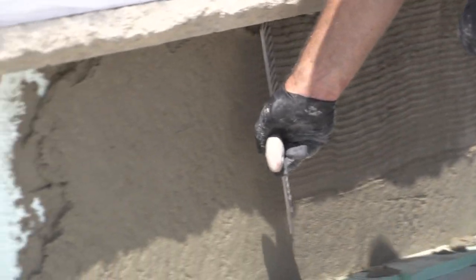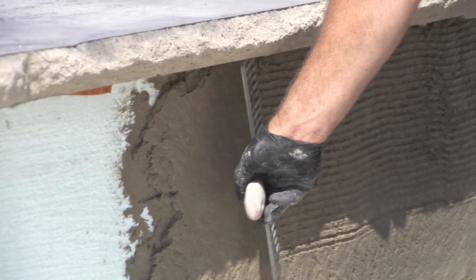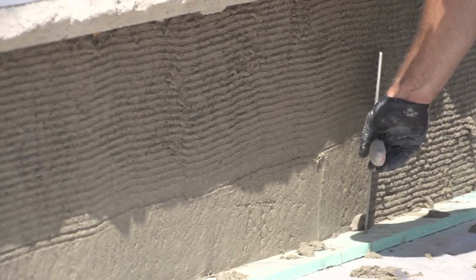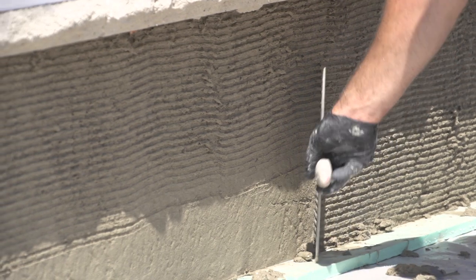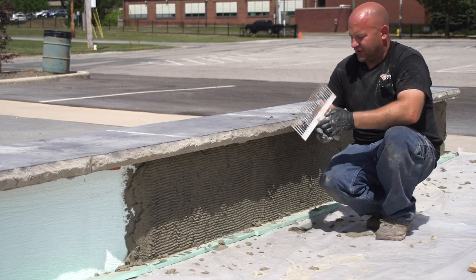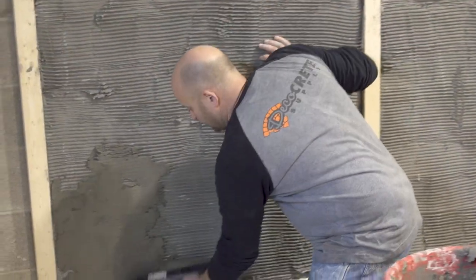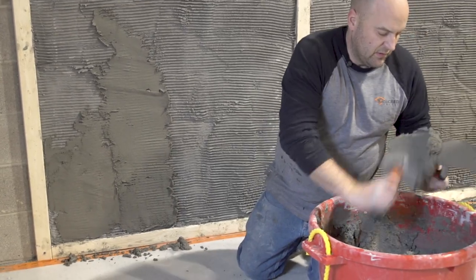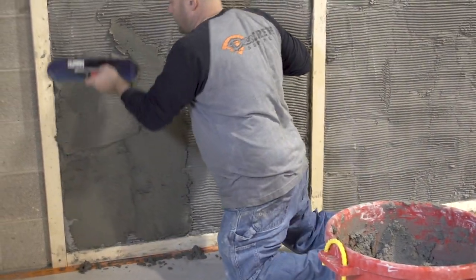What I'm going to do with this is make these nice little grooves. So I'm just going to take it and run it along here. As you can see, that makes it nice and rough — puts those nice lines in there. Now when I drive my next coat into this with the trowel, that fills up all those voids once this gets hard, and that'll make it bond to that a lot better.